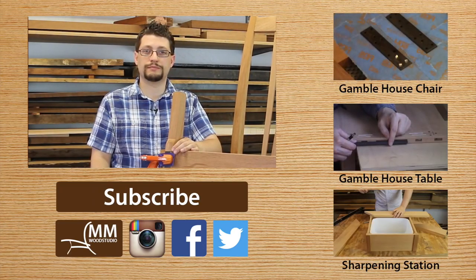I'm ecstatic — I couldn't be any happier with how all of that came out. I did do one thing though: before I did all the surfacing on the front legs, I marked out the exact center locations for where I'll be drilling a dowel that the arm's going to use to hook into the front legs, as well as the angled mortise and tenon joint right here.